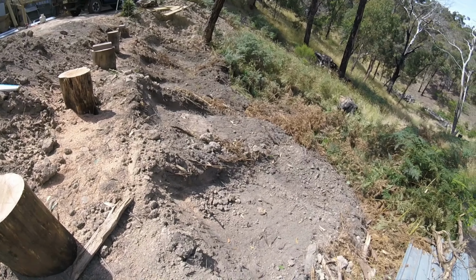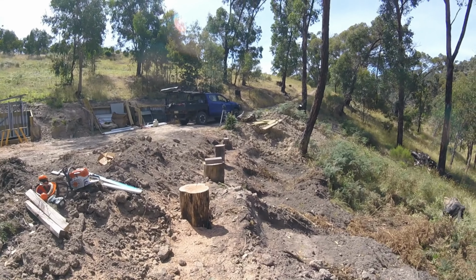What I think I might do to ensure that the holes I put in are actually square to the center line of these is bring over one of the steel frames from over there, rest it on these posts, and lift it up so that it's horizontal. Then I'll mark where the corner is with a plumb bob, and that'll give me the exact center of the hole over there. Do the same thing for this hole, then do a string line between them, and spray paint where the holes need to go, because I know that frame there is perfectly square. I'll set that at home with an engineer's square. So I think I'll do that. I'll bring those frames over, and we'll have a go at setting it.